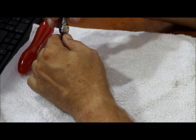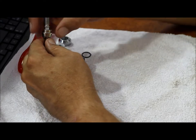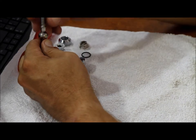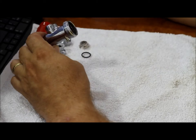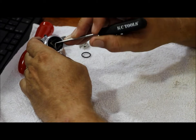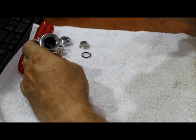There's also the bonnet seal that goes in underneath the bonnet, and the bearing cap which faces with the opening forward on the tap, then the shaft assembly. There are only four seals inside the 525. At the very back section we have the coupling gasket, which is a square profile gasket.